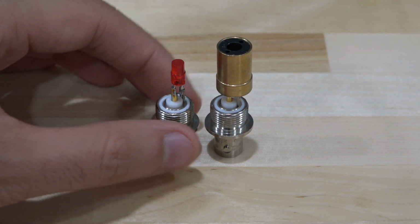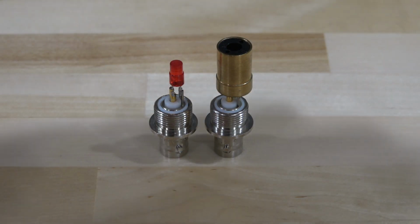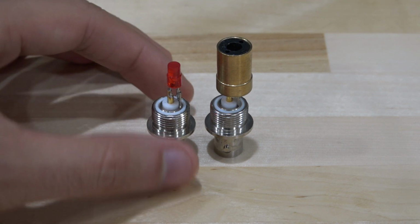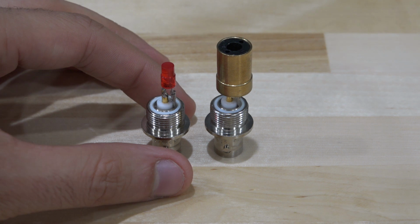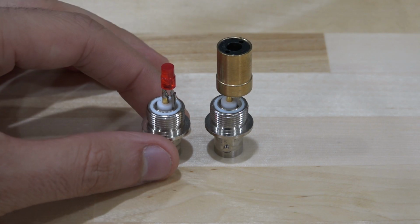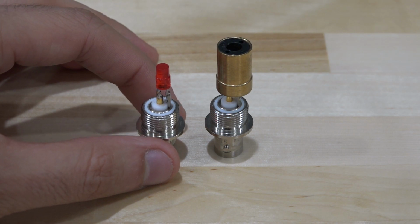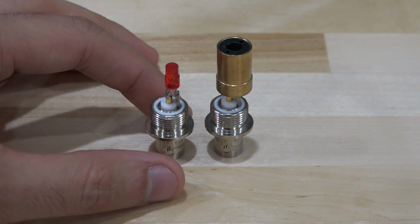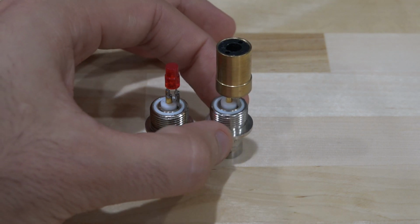Well, there's actually even more complications. Because the ambient light from the room itself is made of many different wavelengths, so if I were to cast a shadow on it, the current is going to change. So it makes it even harder for me to find out what is this responsivity to a particular wavelength of light. And you would have to enclose it in a very fancy case and make sure there's no light, and make sure there's no reflections of the light, and there's so many other precautions you would have to take just to make sure that optically you're protected and you can do measurement at a single wavelength reliably. And then on top of that, you're going to have the noise from the measurement itself. Because you have such a small signal you're trying to measure, source noises, as I explained before, are going to swamp your measurement.